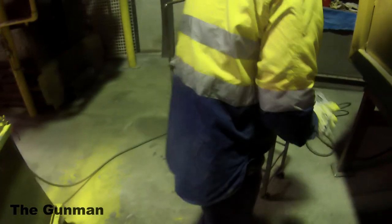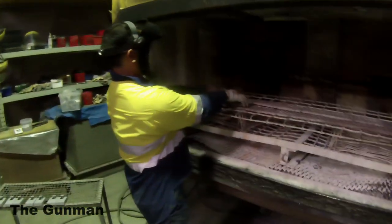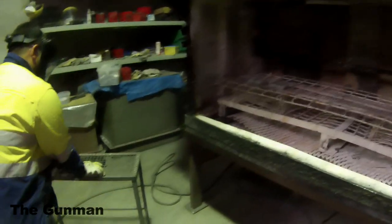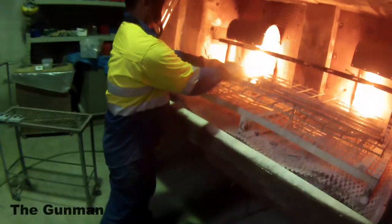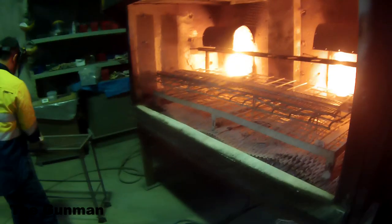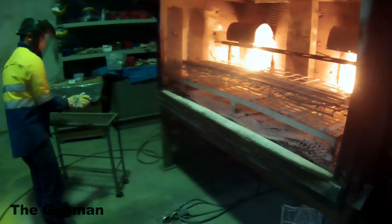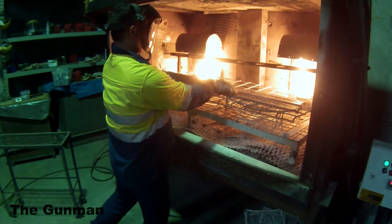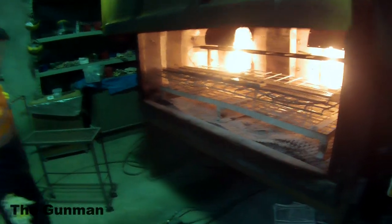I'll break this system down in layman's terms. Everybody knows what happens when you heat up plastic — it melts. That's exactly what they're doing here: they heat up the part, put it into the plastic, the plastic melts onto the part, then bake it again to smooth that finish out. It's really as simple as that. There he goes, just stacking all those parts in there — he's made sure they have little bits of wire so he can hook them onto that second oven.